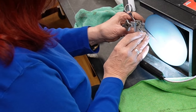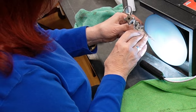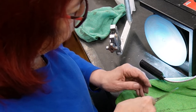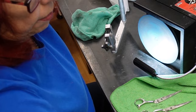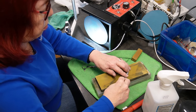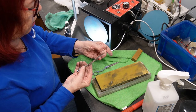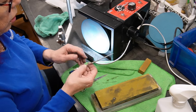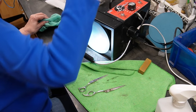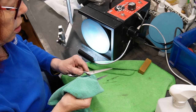These were the best of the bunch of the three for the cutting. My next step is to knock off that burr, and I want to check the ride line to make sure I didn't remove so much metal that the ride line is gone. If you get a great big burr, you might completely remove your ride line and then you've got to start over. That doesn't look too bad, so I'm going to polish it now.